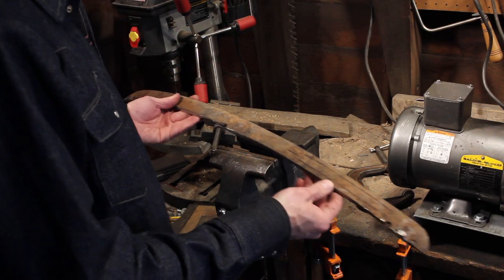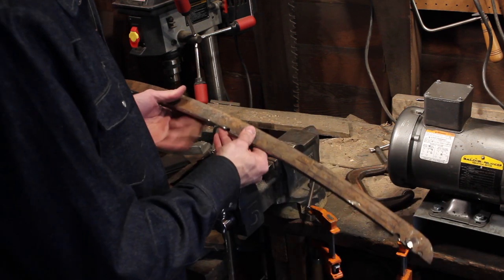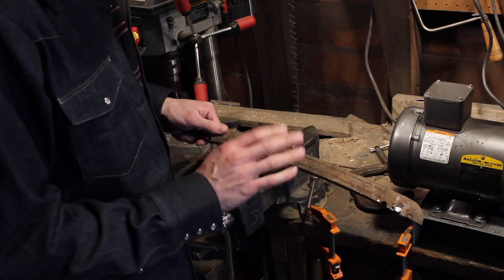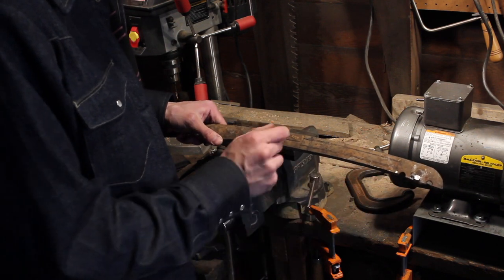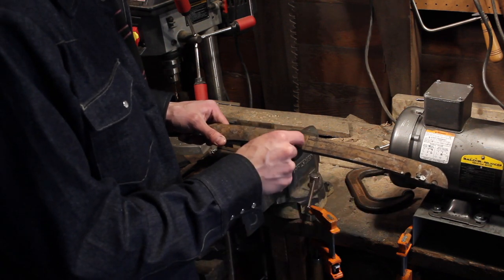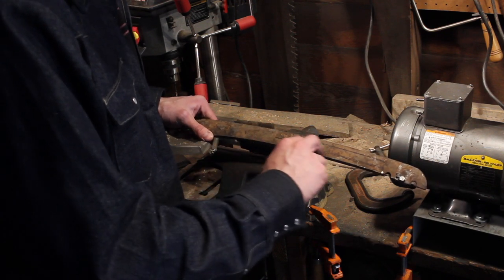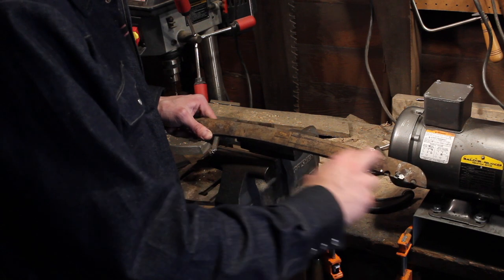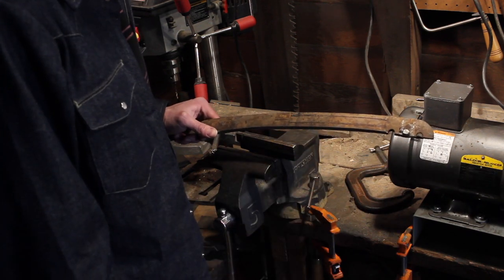So this is the other half of the spring that we cut down for the sword itself. To have those three strands, I need something that's fairly broad. So I got this sketched out of what I'm going to do here. We're going to put in our slot for the tang, so I'll do that in the forge. And then we got these three strands right here. I'll cut these out with the angle grinder, and then I'll do all the shaping in the forge.